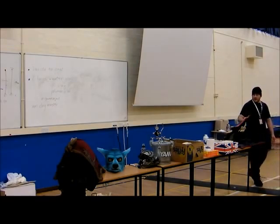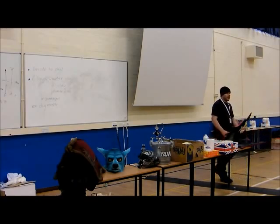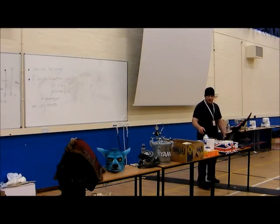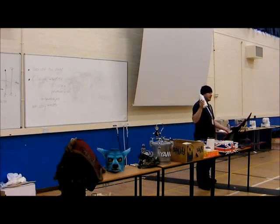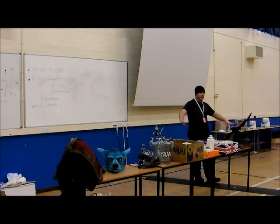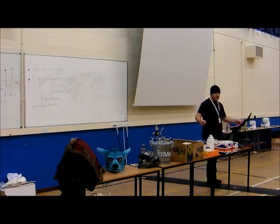What I did first, you use something called a gel coat. Now gel coat into latex again, not a good idea. So inside the latex, a layer of PVA. It's not touching latex anymore. So a layer of gel coat. Now what gel coat does is it gives it a perfect surface. Second layer, really, really fine tissue.